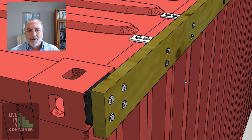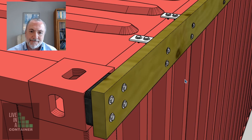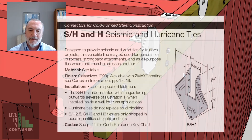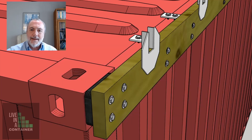Now that you have the Domino Clamps and the secondary clamps in place, you can bolt a nailer all the way down the shipping container. I'm showing a two-by-six as a nailer, bolting it into the black item on the corner casting. The Domino Clamp has four holes where you can connect anything — for example, a pole to hold a light. In this case, the two-by-six is also bolted onto the secondary members all the way along the shipping container side. Simpson makes connectors for this, and I'll give you links down below. I'm choosing one configured so it can be screwed into this nailer all the way down.